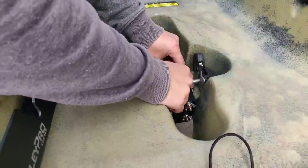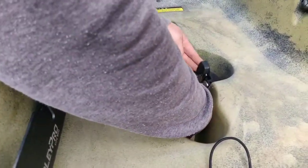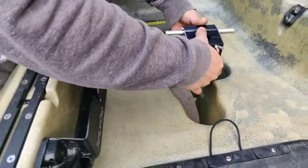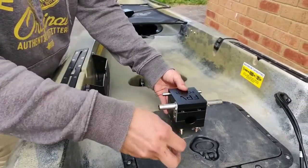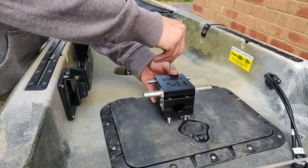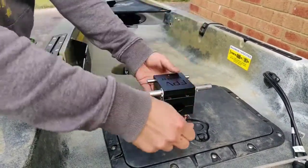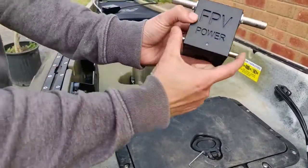After the bottom lower pin has automatically centered itself left and right, you want to just carefully pull it straight up, and without disrupting the lower pin, do not tilt it on the side so that you slide left or right. Put it down, grab the Allen key and tighten it like so, just finger tight, and that ain't going to go nowhere. See, it's locked in the center point.